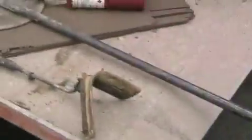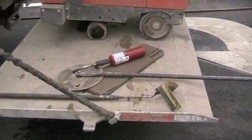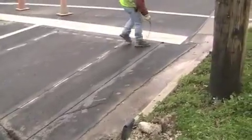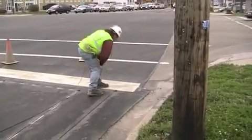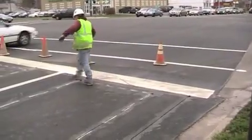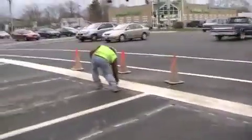Now the contractors are just getting the equipment ready to install the loop sealant. The reason these loop detectors are being installed is because of a water main project that went out there this fall and cut straight through the loops with the services. You can see the contractor here reeling off the loop wire off the back of their truck and putting it within the saw cut.